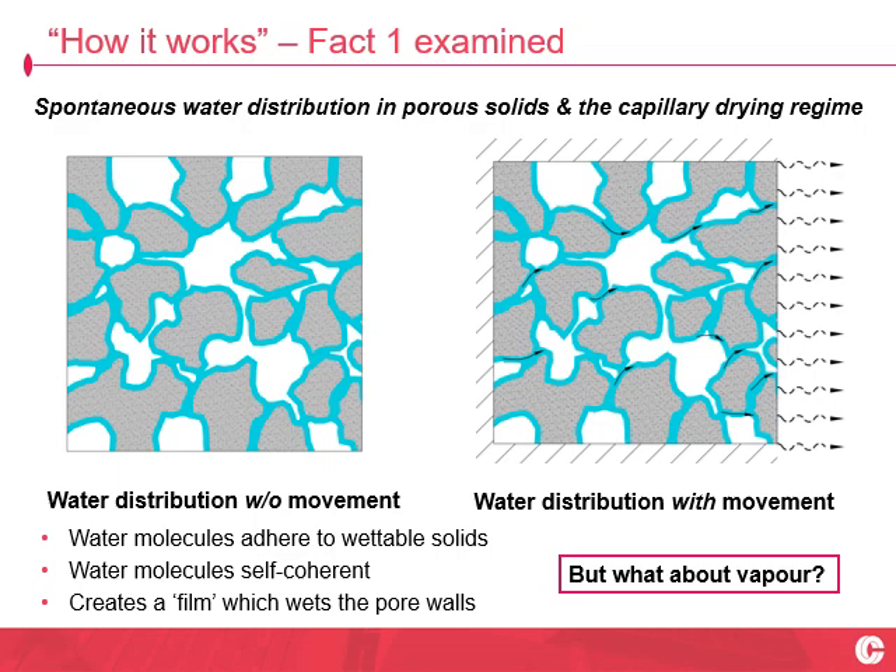At the drying front, the drying of wet stuff is principally driven by wind speed across the surface. This evaporation front is physically ripping away water molecules. That opens up a wee bit of wettable surface at the drying front, so the next water molecule — the next guy in the queue — bumps forward to wet that free surface area. Because he's self-coherent to his pal behind him, he pulls them along and essentially the whole chain starts to move. You get a capillary flow towards the drying front. As more and more mass is removed, the film becomes thinner and thinner. This is the heart of the capillary drying regime — a very efficient way of getting water out of stuff.